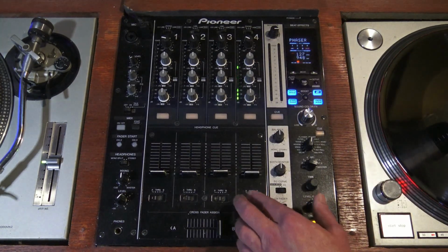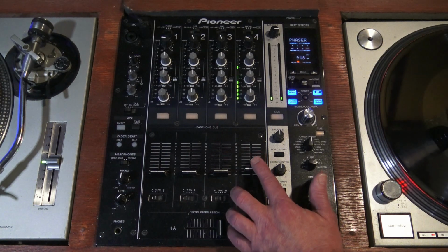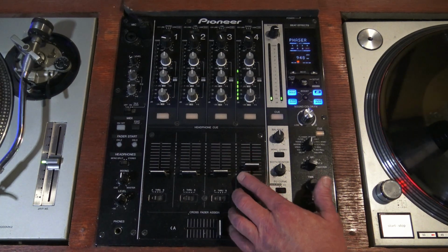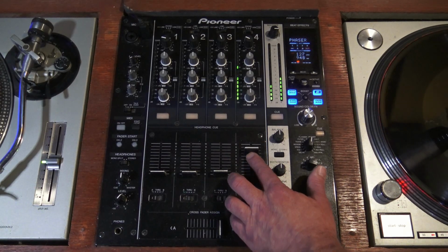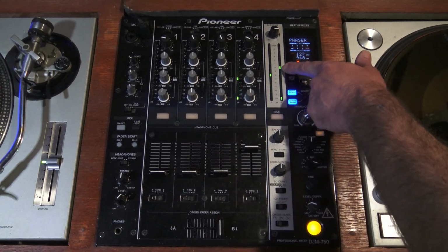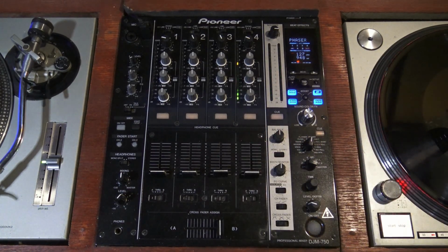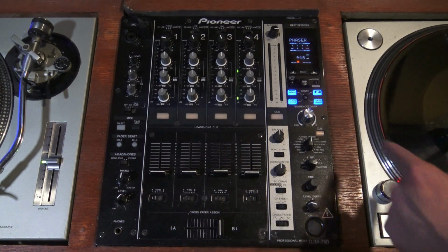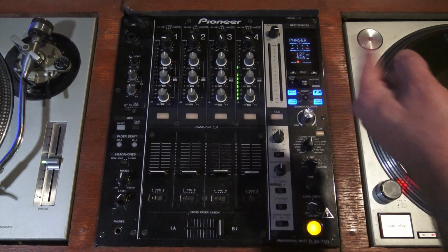On some mixing boards, 0 dB is represented as the first amber light, but on this one it's the last green. Now, if I start to play with my line fader, this is my volume that I'm going to use for my tracks, okay? It's not going to be this, it's not going to be this, it's going to be this. If I go up to 8, notice I'm hitting 0 dB on my master. That's because the loudest signal I want to send to my speaker is 0 dB. I don't want to go higher than that. If it spikes up to plus 2 once in a while, not the end of the world, but the objective is 0 dB output of the mixing board, and that's how I achieve it.